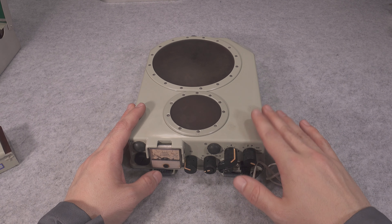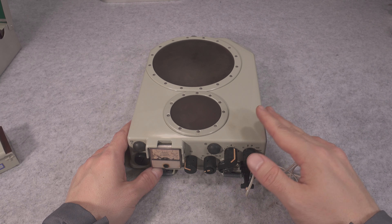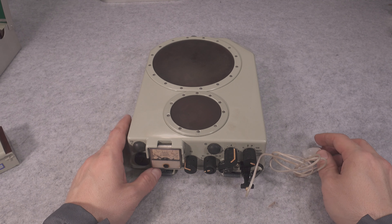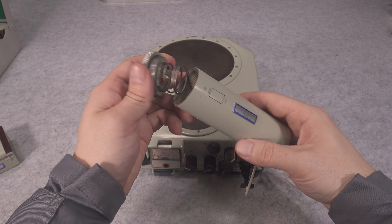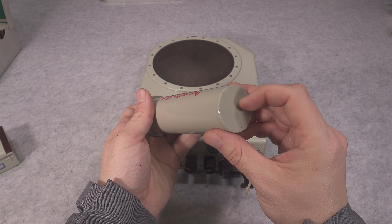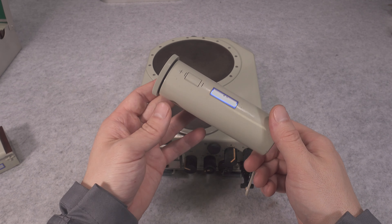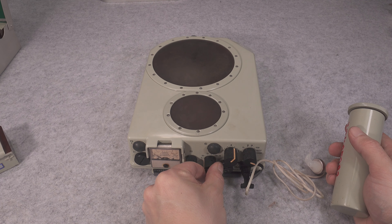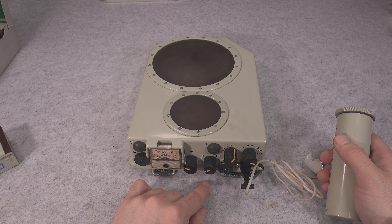This device is extremely simple. It is not a radio receiver for demodulating signals — it's not going to decode FM or AM audio. It is designed only to detect those pulses. You've got a test tool for checking that: put an R20 battery inside, press the button, and inside is a relay that constantly clicks, creating sparks and RF signals picked up by the device. You can check all bands — if you don't pick up anything, you'd need to swap one of those diodes.